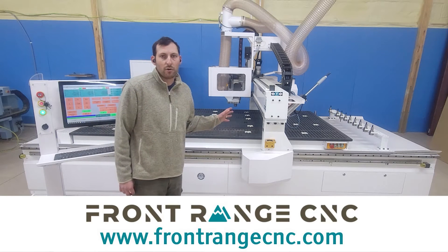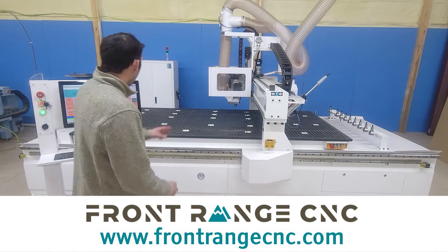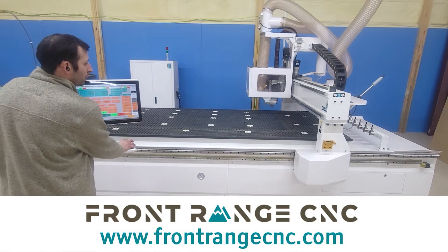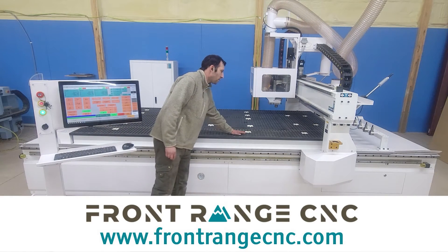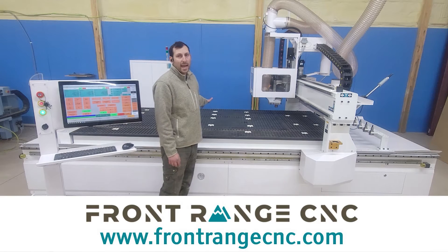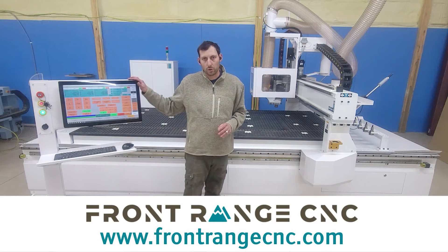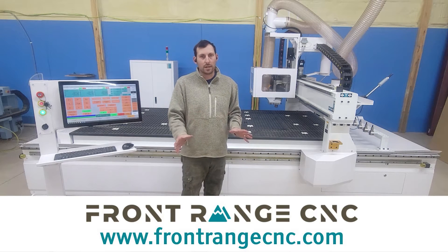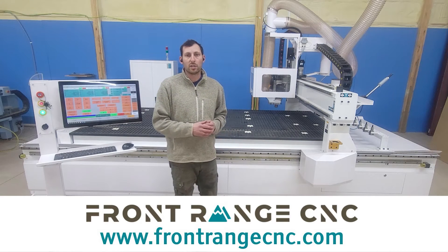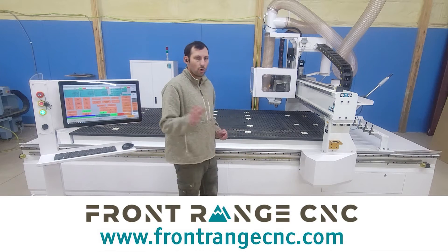This particular machine is roughly 5,500 pounds. It's got a six-zone vacuum table. All of our zones are controlled by the actual controller itself. There's a zone on the side, a zone on the top — that would be our 5x10. There are four zones that signify the 4x8. All of the zones are controlled with a touch screen at the controller, so there are no opening and closing knobs. It's all done at the controller, and that can also be coded into your program so an operator doesn't inadvertently forget to open or close a valve.